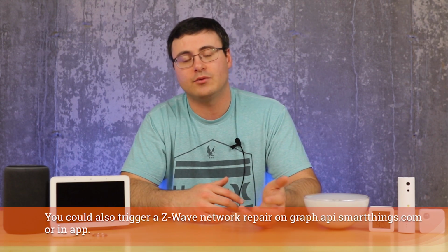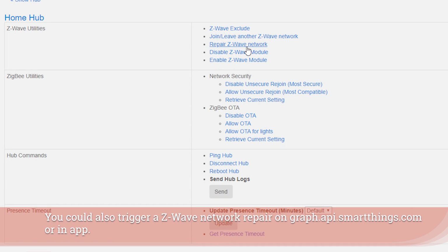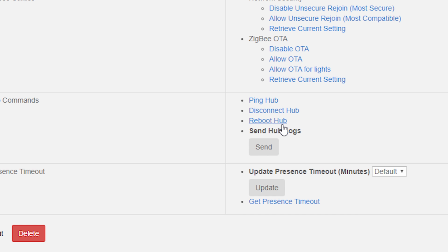That's my recommendation for you, because in a lot of cases, Zigbee or Z-Wave networks take time to repair themselves. So plug in your stuff. If it's a light bulb or a light switch or whatever device it is, if it's Zigbee or Z-Wave, give it some time, let it just sit there and let the network self-repair, and be patient. If you do that, 90% of things will come back. You might have to reboot your hub every once in a while. Once I rebooted my hub 2 or 3 times and let devices sit there, everything came back online with those networks.